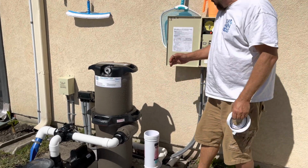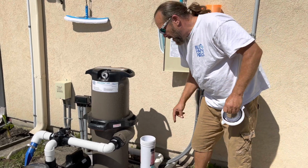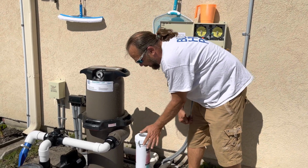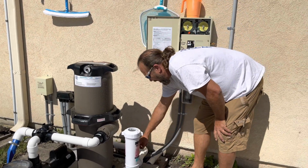So you're going to turn it off. You're going to open it up. You're going to take the 3 tablets I'm going to give you here in a minute. You're just going to put them in right on top of those 2. Those 2 are still melting. Just cover them up, okay? And then put your lid on until it's snug and just tighten it. That's it. And then this is how you adjust how much water.